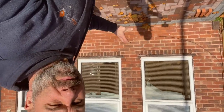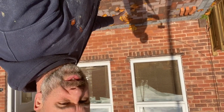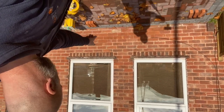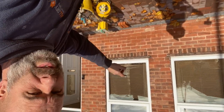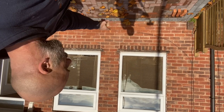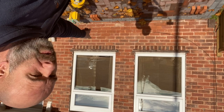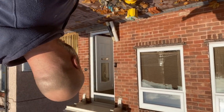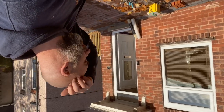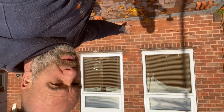I'm showing it from outside. I've had this block paving done last year, and you can see where the subfloor air vents are - it's a timber floor on the inside. The subfloor air vents have been covered over. I'm not sure what that middle section is - it probably thought it was a cavity. We've got them outside, it's a proper decent level on that side, but these have been covered up.